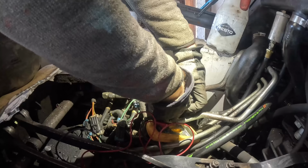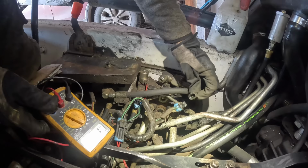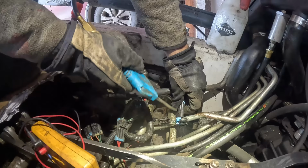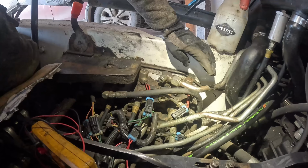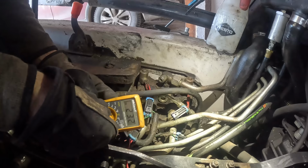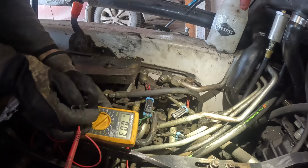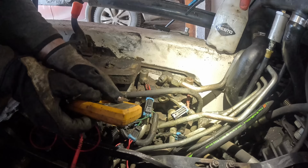Sorry. Anyway, we should get somewhere around 9 volts. What? Why are they all filled with oil? How did it get in there? It should be a sealed plug. So one solenoid should operate the hydraulics one way, the other the other way. And the solenoids should work at around 10 volts, or maybe it was between 6 and 9 volts. So guys, you don't want to put 12 volts on those solenoids. You will break them. Don't do that.